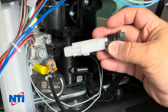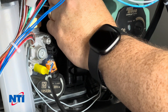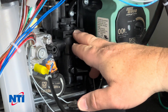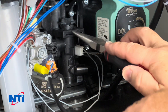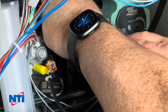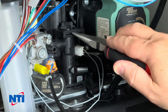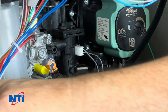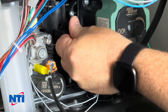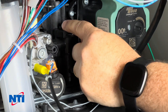If it's okay, reinsert it. You'll notice there's a tab in the front — that faces forward. Line it up and put good pressure down so it mates up flush again. Reinsert your clip — you want a good sharp click so that you know it's seated.